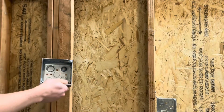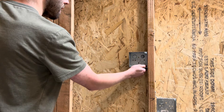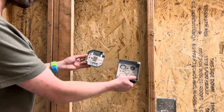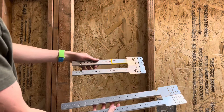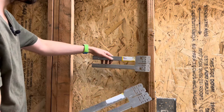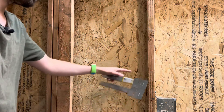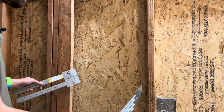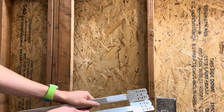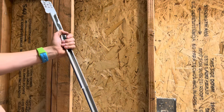For these next boxes you could screw directly to the stud, but it's not going to be the most sturdy — it's going to wobble a little bit. There's a different way to mount these boxes and that's with a spreader bar. These are spreader bars and this is what's going to be holding up your box. For a longer span use the bigger ones, shorter span use the shorter ones. I'm going to use the bigger one going from this stud to this stud — hence spreader bar. To use it, all you do is fold these apart and put the two pieces together in the middle.